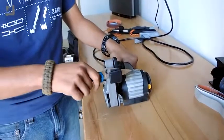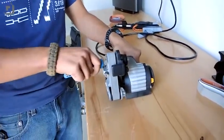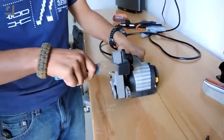One other thing to point out: when you're doing this, it's very important not to overheat the blade. With any kind of machine that drives a belt, you can get that belt going so fast that you heat the blade up tremendously. If you heat the blade up, you will damage the heat treatment on the steel. If you've ever watched TV shows about forging knives, they'll stick it in the fire, get it red hot, and quench it — by heating and rapidly cooling it, you lock in the hardness. With any kind of machine like this, if you get the metal actually glowing a color, you have damaged the blade. One thing you can do is keep a glass of water nearby — as you're sharpening quickly and you feel it heating up, dip it in the water, then keep sharpening. That'll keep it cool.